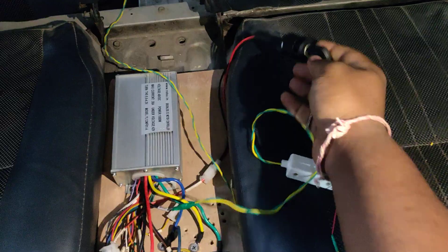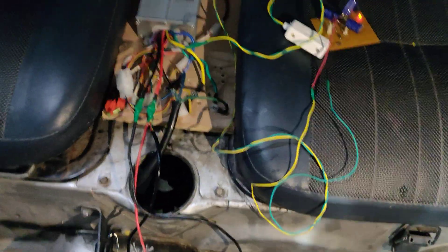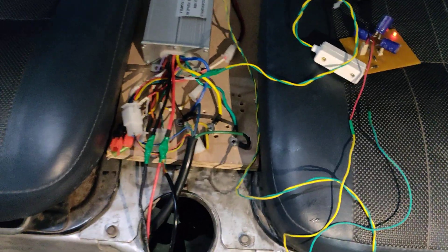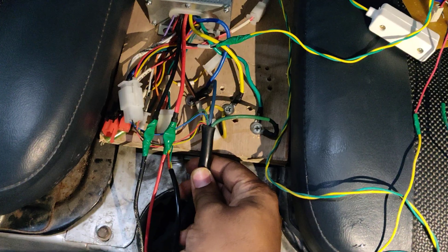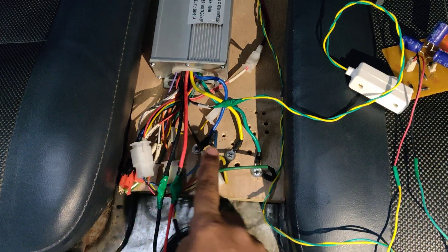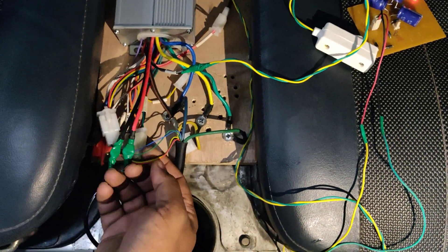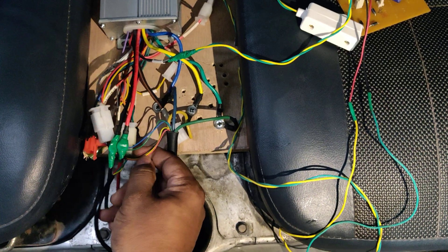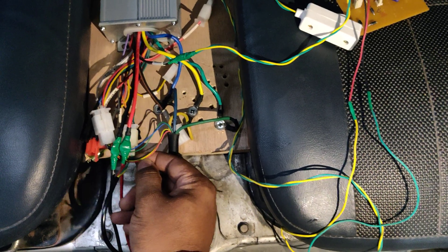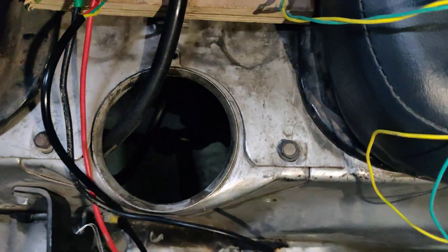The battery input is connected to the microcontroller driver directly through crocodile pins. From the driver, there are totally eight wires: three wires — blue, green, and yellow — are the three phases for the BLDC motor. The remaining five wires consist of three hall effect sensors for each phase, and the red and black wires are the power supply pins for the hall effect sensors.